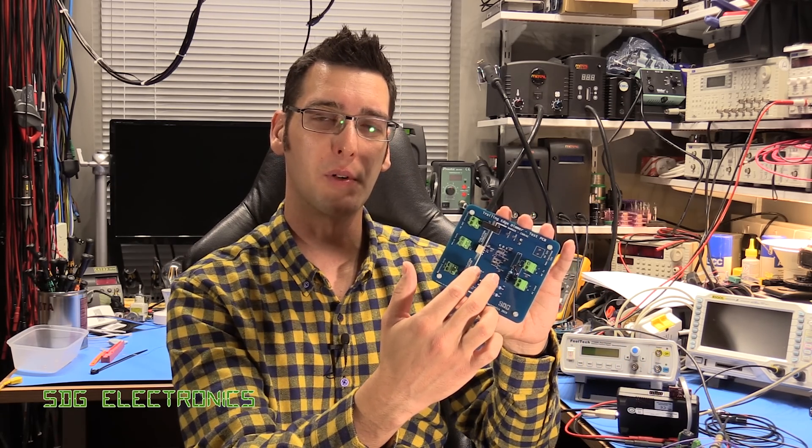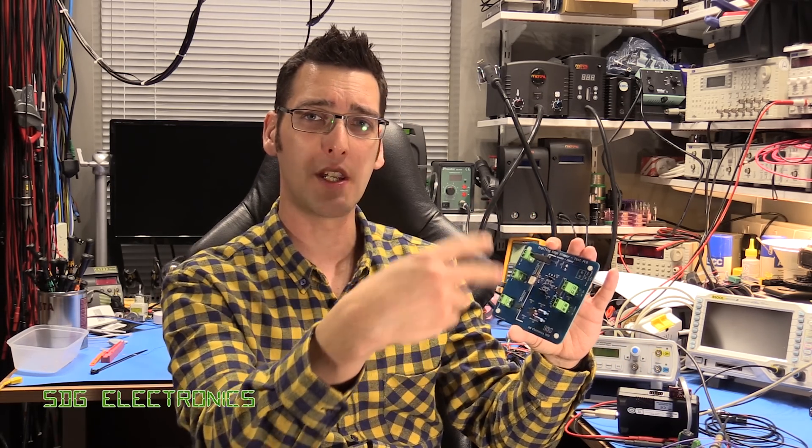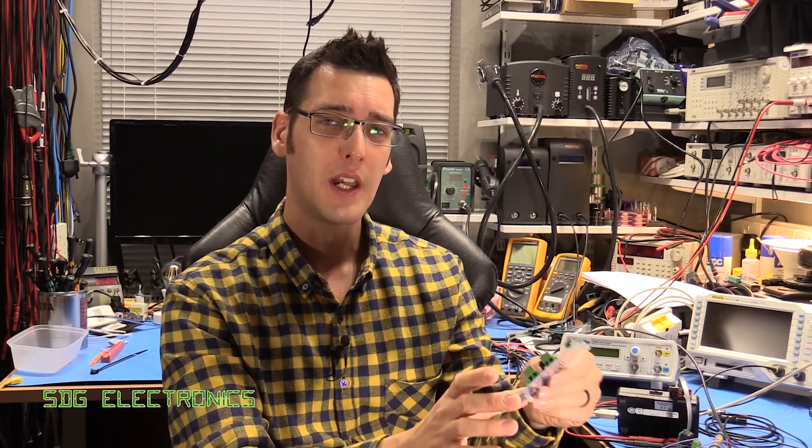I was thinking about the best way to demonstrate this for the video. Hopefully you've watched my video on isolation transformers — I'll link to it above — but although it is possible to probe differentially across, for example, the MOSFETs on this board that are going to be riding the AC waveform, it's not necessarily the safest method and it is very easy to create a really hazardous situation. So I was thinking of a safer way of doing it, and that is with a differential probe.